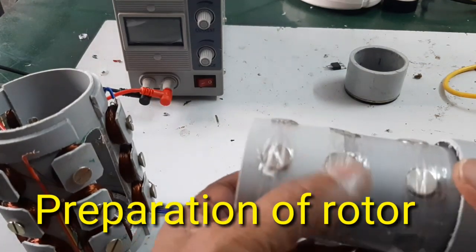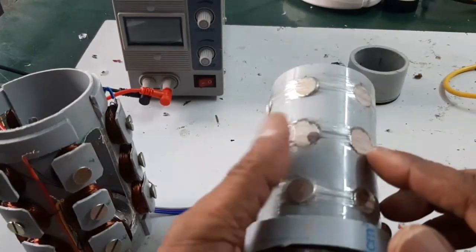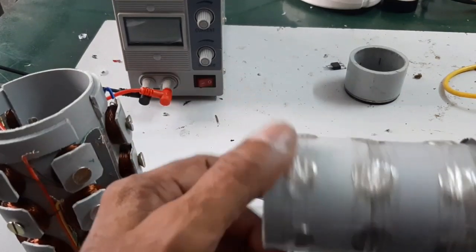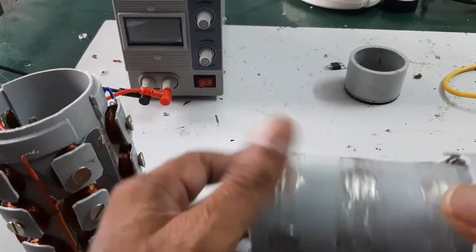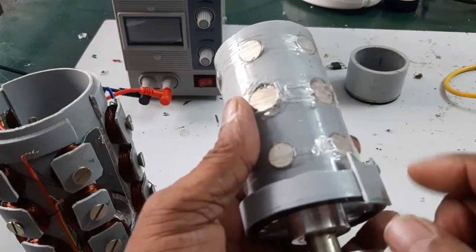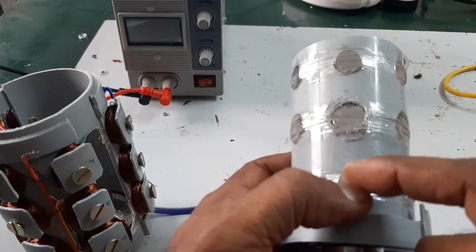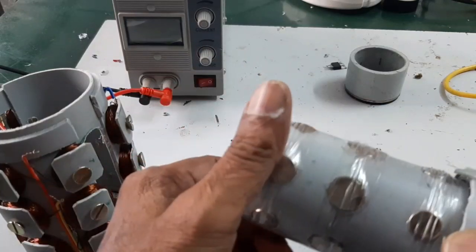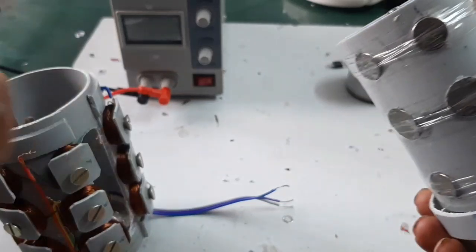This is the PVC pipe — make a hole for inserting the magnets here. Three times six gives 18 poles provided. The magnets are alternating pole: north, south, north, south, and north. The alternating poles are arranged. Now I am going to insert the rotor into the stator.